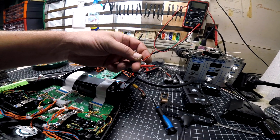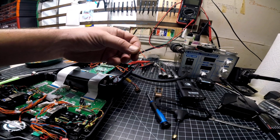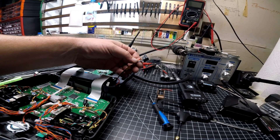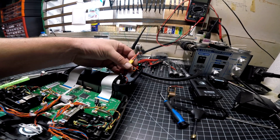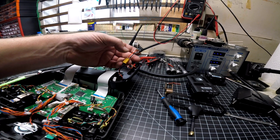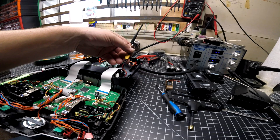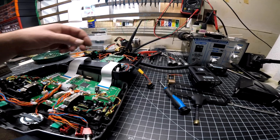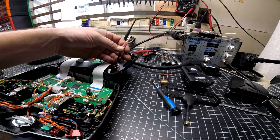The stock wiring is around 30 AWG, which I replaced with 28 AWG heavier wire. I also added an XT30 plug — the XT60 would fit in there too, but I had an XT30 sitting around so that's the way I went. I desoldered the small stock wires, put heavier wire on it, and added the XT30 connector.